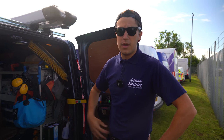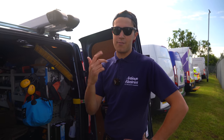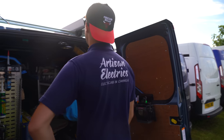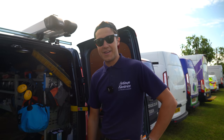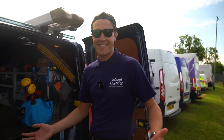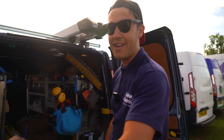It's going to be quite an interesting route — we've got to take it underground through a duct, and I have no idea what size it is. We've got to get two cables through: our armoured cable and also an armoured Cat5 cable. That should be a big bag of fun. I am sporting my Chicago Bulls cap — sorry Americans, in England when you wear NBA stuff it doesn't necessarily mean you support that team.